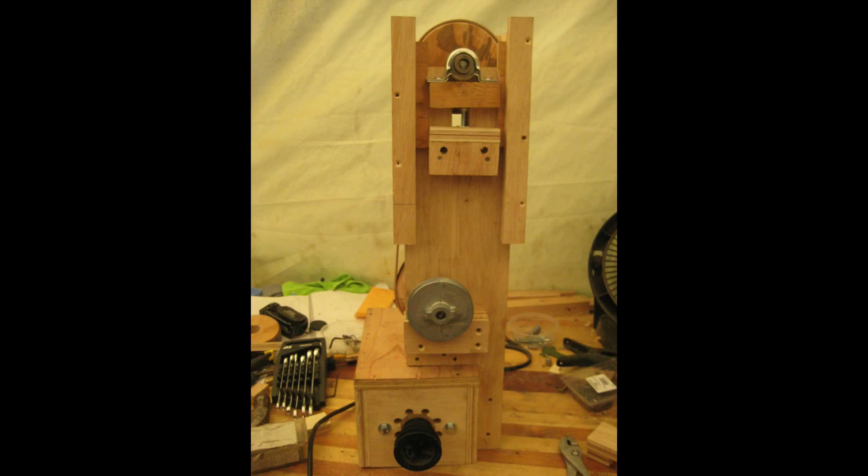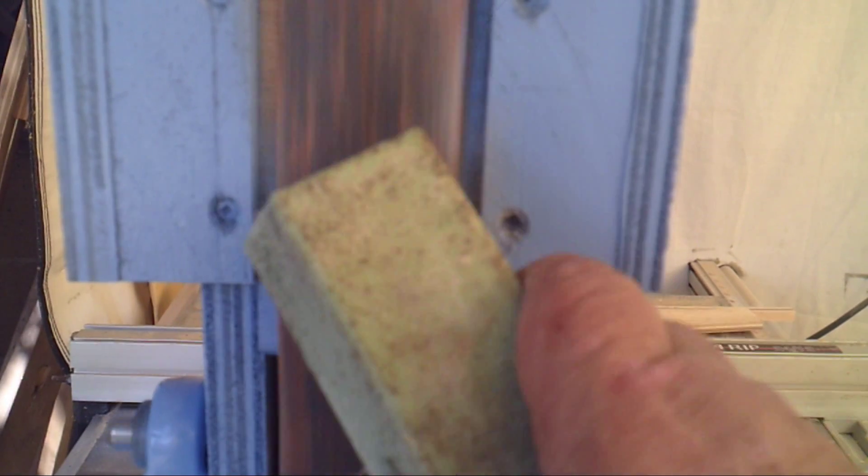You can see how this is coming along. I used half-inch pillow block bearings — the cheap ones; they don't need to be expensive. Right here you can see the tensioner and how it works. This is a long screw and a T-knob on top of a little block that I built, so you can adjust the size to center the belt — not only tensioning it, but also adjusting the run-out. And there's a backup board so that when you apply the chisel, it won't go too far in.